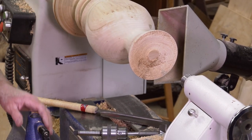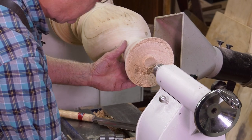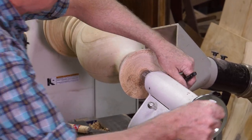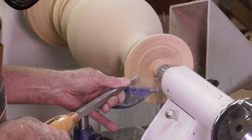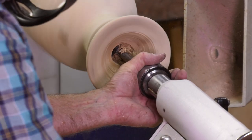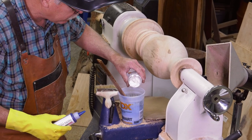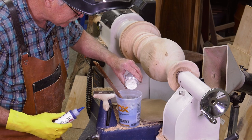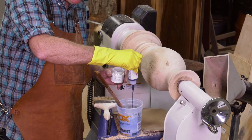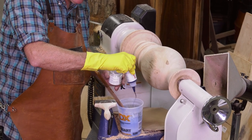I'm going to clean this up a bit by bringing the live ball bearing center forward. Now that it's balanced and well-behaved I can cup this out — I want to make sure it's on center. I'll advance that and smooth cut this. Once that's smooth, I'll put this in and core it so it will hold flour. This container has high-performance water-based finish with iridescent metal particles. This is a blue water-mixable dye called Union Blue, and I'm creating a glaze for this basswood.